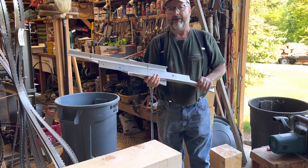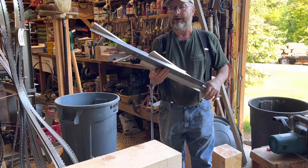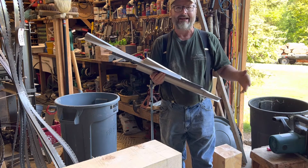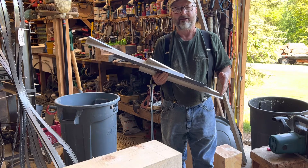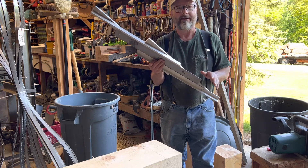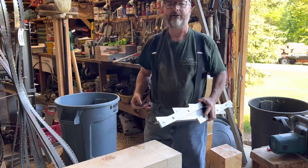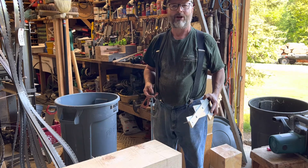If you don't have one of these and you haven't made one, take a look at what I've described. You want to have one of these in your shop because whether your timbers are perfect at your 8-inch mark, your 6-inch mark, or they're a little off because the sawing is rough-sawed and it's not perfect, you want to make one of these and you'll get a perfectly centered mortise or tenon every time. Thanks for watching — if you get a chance, please subscribe to the YouTube channel and give some feedback.